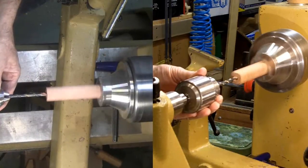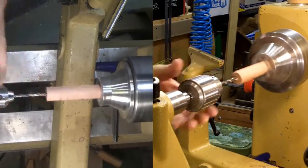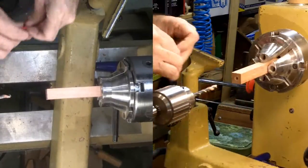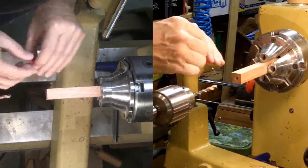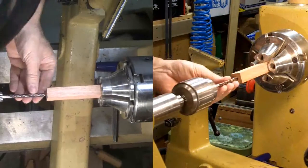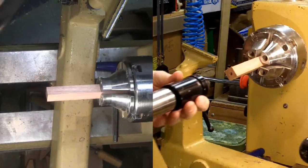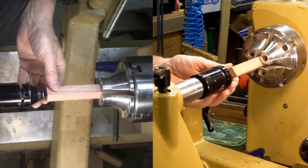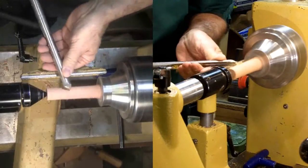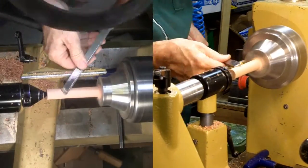This one needs about a quarter inch hole about one inch deep. I also drilled a three-sixteenths hole another one half inch deeper for the point when the ripper is closed. After testing the hole with the ripper, I went back and drilled a slightly larger diameter hole. Then I brought up the tail stock very gently and turned away. At this diameter, rounding goes quite easy. I used a large bowl gouge, then alternated between a spindle gouge and a skew. The skew gave a better finish.